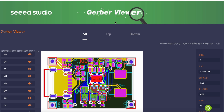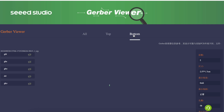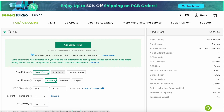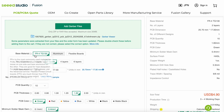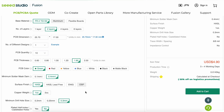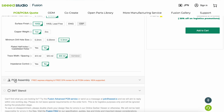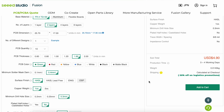If you want to view your Gerber files you can click on Gerber Viewer which is also integrated in Seeed Studios. This is how the PCB is going to look — you can check the top as well as the bottom layer. Here we have base material options which is FR4, and we can also go for aluminium and flexible PCBs as well. Then you can select number of layers; PCB dimensions are already filled. And then you can select the color, the thickness of the PCBs, your solder mask. Seeed Studios also gives PCB assembly as well as SMT stencil options.